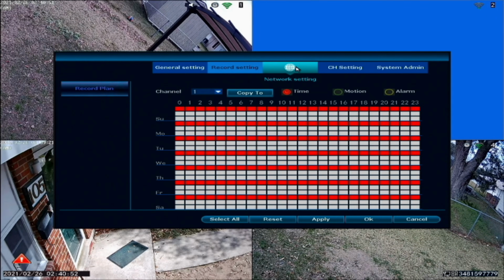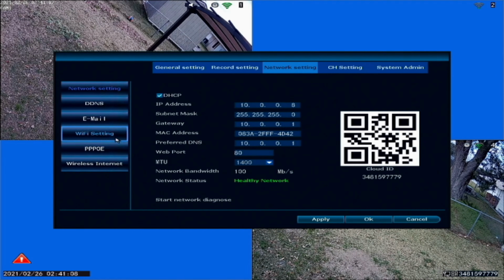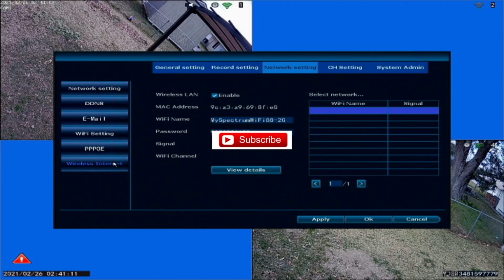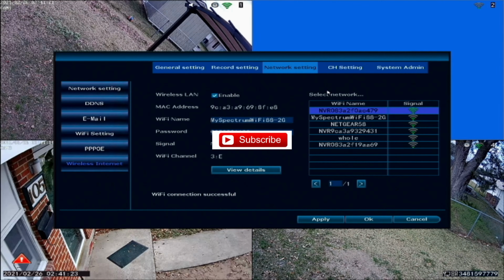Now this is the most important part because most of you are going to download the app. Once you download the app, you have to add the system to your router. Okay, so come right here, network, and you want to go to wireless internet. It's going to give you a list of Wi-Fi names. You choose your Wi-Fi name, put in your password, and then click apply. And that's going to add it to your router.